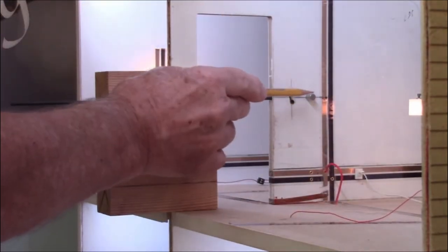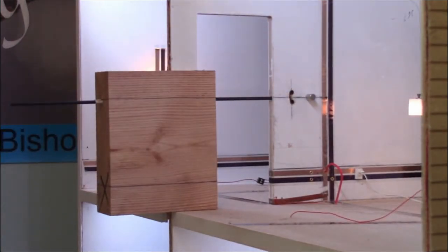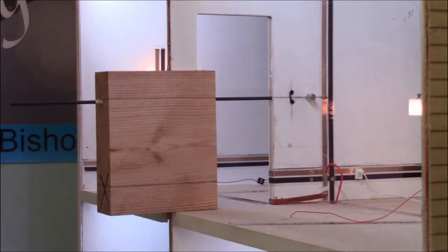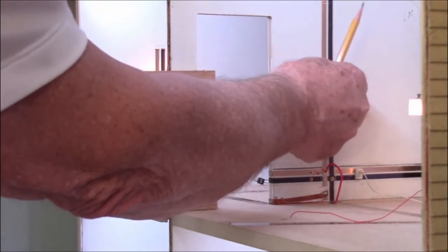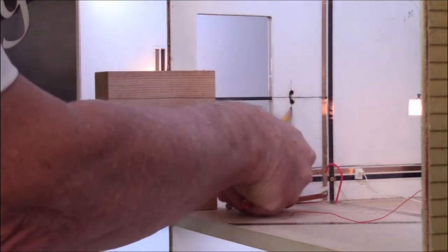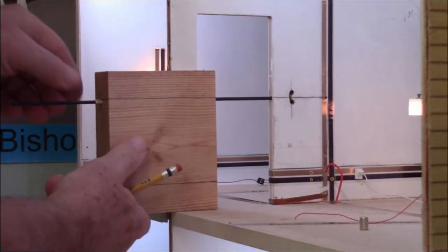So you can see that the magnet catches there, and we're right dead center on the line that I drew previously. I generally will drill this hole first and then line up for the 2 1/8-inch holes for the wall switch later on. But I wanted to make sure that we were all the way over to the flat tape run, and you can see that the magnet lines up perfectly with the tape run, so we know that we have our hole far enough to be able to go. I actually went just a little bit further with it so that I'm about the middle point of the flat tape.